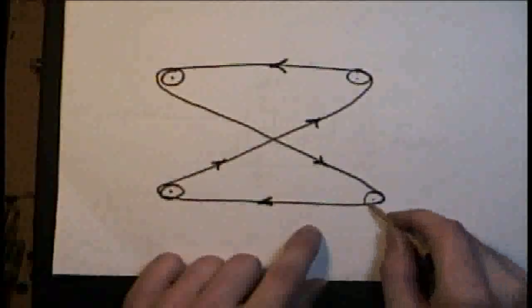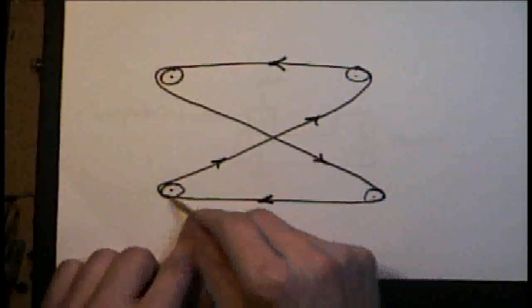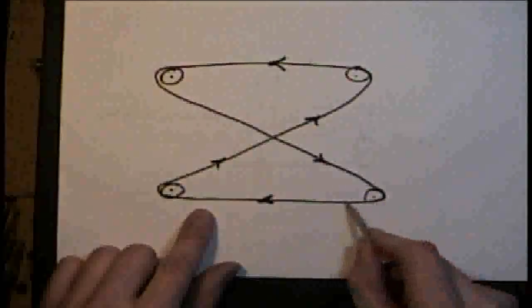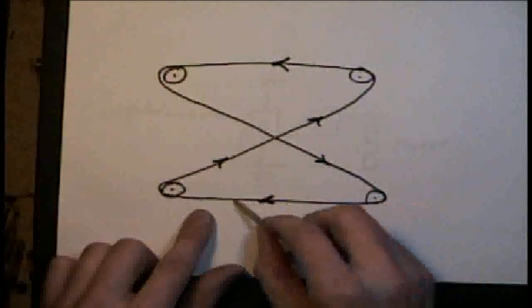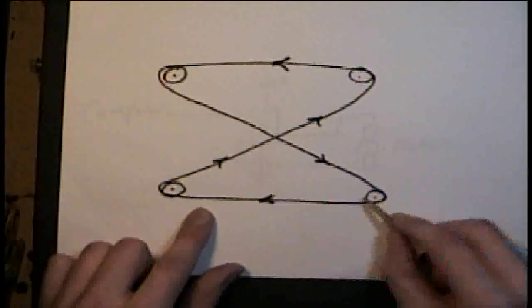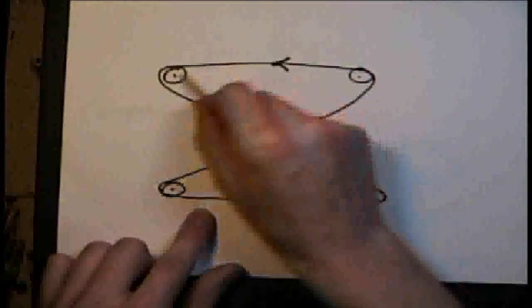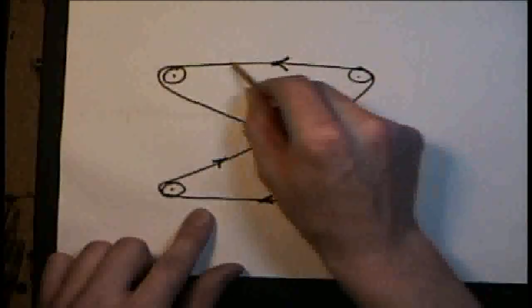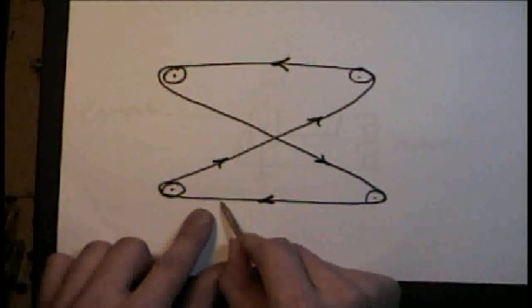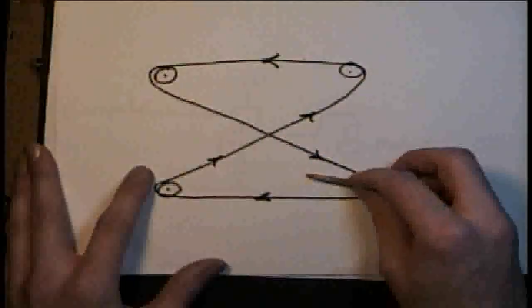Here's the mechanism that I built inside, out of pulleys that are used for screen doors. I had to make some nylon line going in a very particular pattern so that I could have two strings moving in the same direction when we turned one of these pulleys. If you pull on one of these strings when you have a zigzag in it, both strings on the side will go in the same direction. Then you duplicate it in the other direction to get your X and Y.